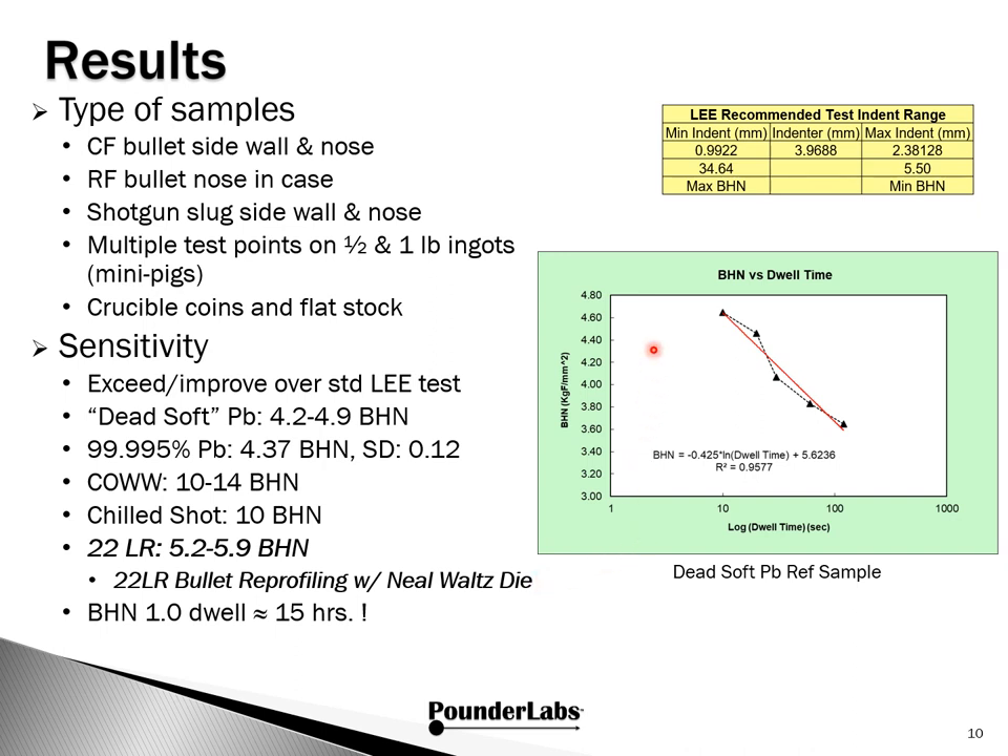To show sensitivity, we did this experiment: Brinell hardness on the Y-axis, dwell time on the X-axis on a log scale — 10 seconds, 20, our standard 30 seconds, 1 minute, and 2 minutes. This shows how important it is to get to your force and hold it for the required time, because time spent getting seated introduces error. The equation fits Brinell hardness as a function of dwell time with a good fit to the data. For the curious viewer, the regression predicts you'd have to hold for about 15 hours to get down to a Brinell hardness of 1, the diameter of our indentor.